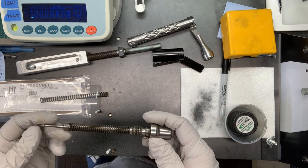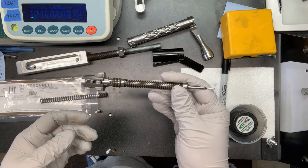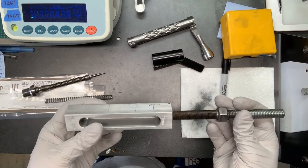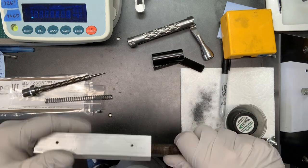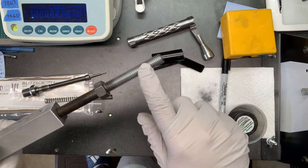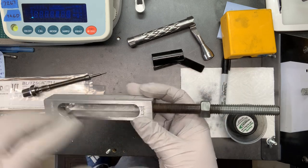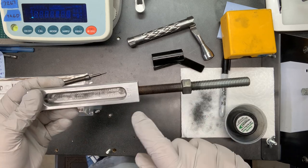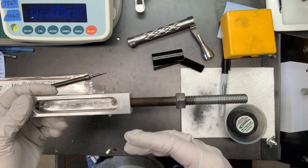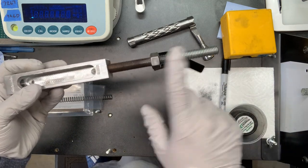You shoot long enough, you hope you hear everything and figure everything out — it's never going to happen. Don't be afraid to reach out to people. So let me show you how this is done. After taking apart the bolt for cleaning, I went and bought one of these, which is a firing pin removal tool. This one is from Midway, and it's nice because it has both Remington and Ruger — coarse thread and fine thread. It came screwed in on the Remington side, which means the empty hole is where your bolt threads into, so you could easily cross-thread if you're not paying attention. Make sure the Remington side is where you screw your bolt in.